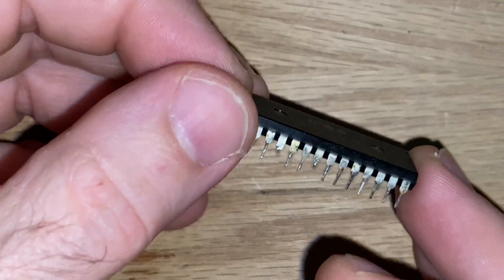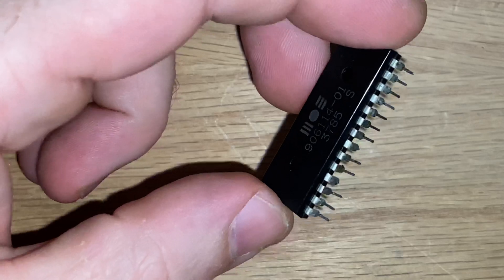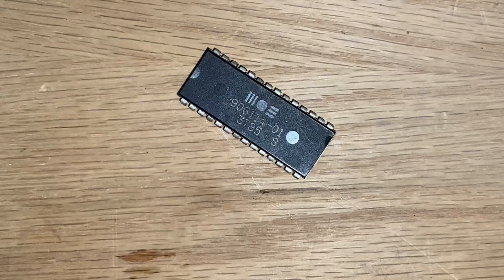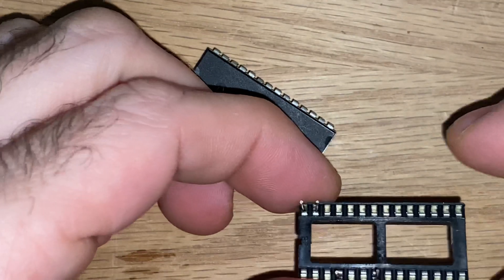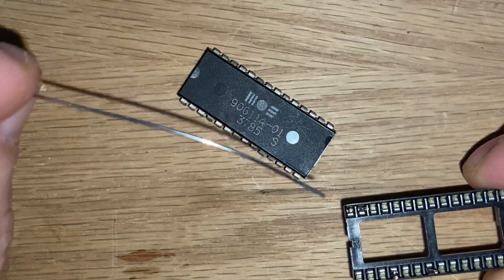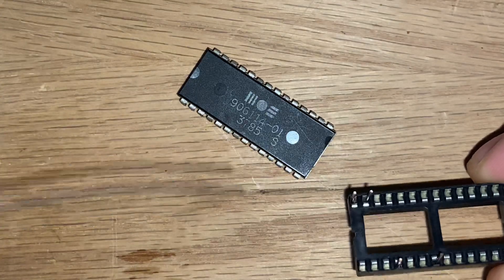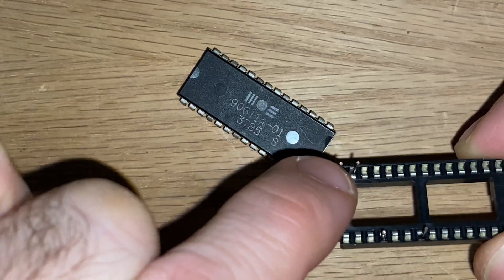I'm not sure if this was the problem or not, but my point is — and this is not just about the PLA chip — pretty much any IC that you lose pins for, you can repair these to an extent. The way that I do this is I use sockets, and with the sockets all I do is get some hookup wire. It's a single-strand hookup wire, and I cut that to about that length and stick it in the spots where the pins are missing.